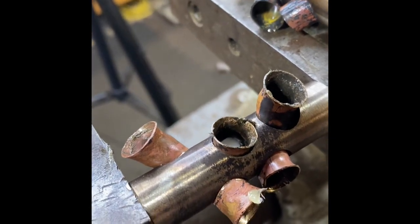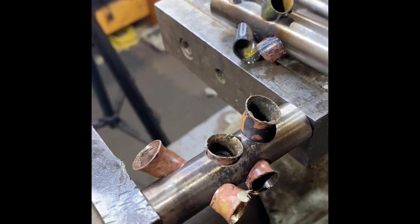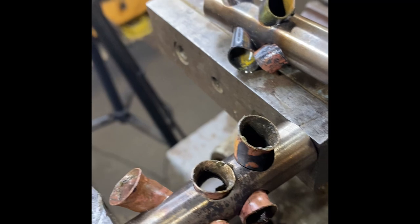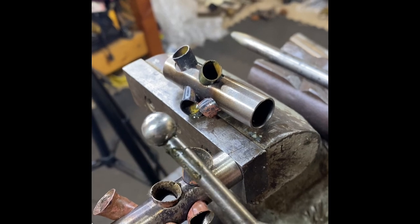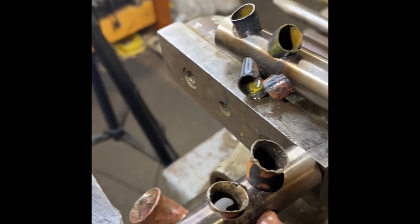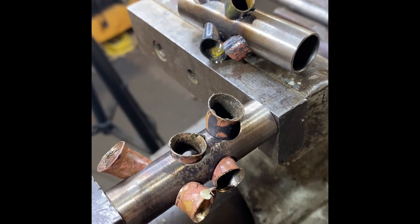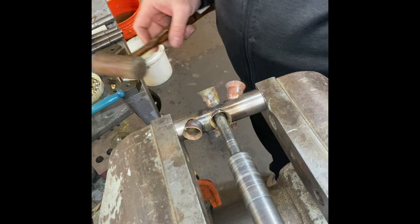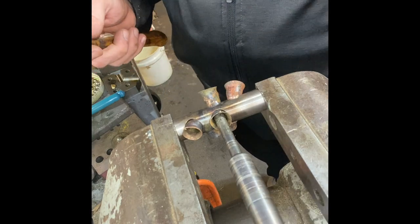From straight rods I move on to rods with ball-bearing ends. It's got a shaft and a ball on the end — I make those here in the shop. I'll start opening it up dimensionally, getting these liners open to size. I'm starting with the balling of each of these liners. This is a steel rod with a specifically sized ball on the head of it, and what I'm watching as I start to go through is I just want to get it past the halfway point.